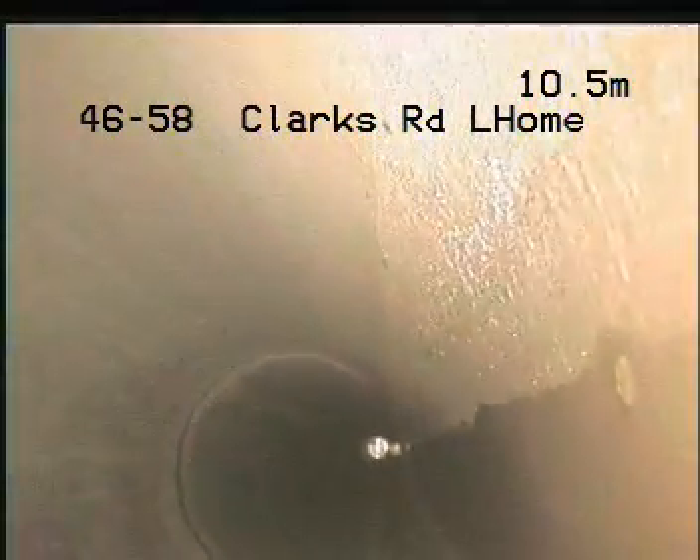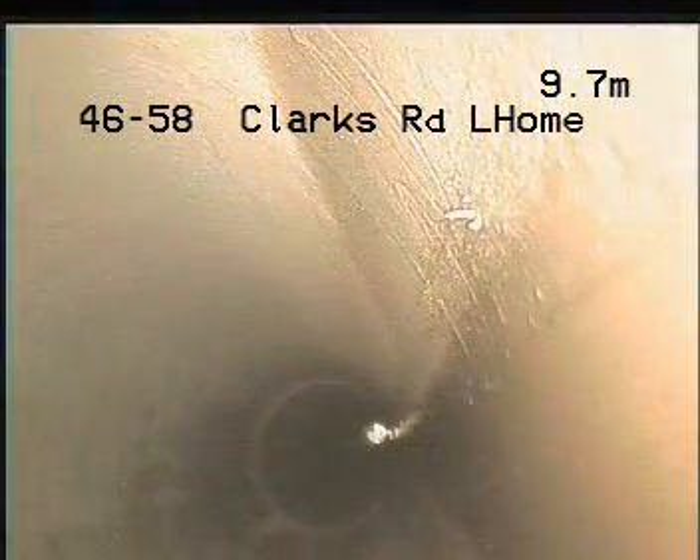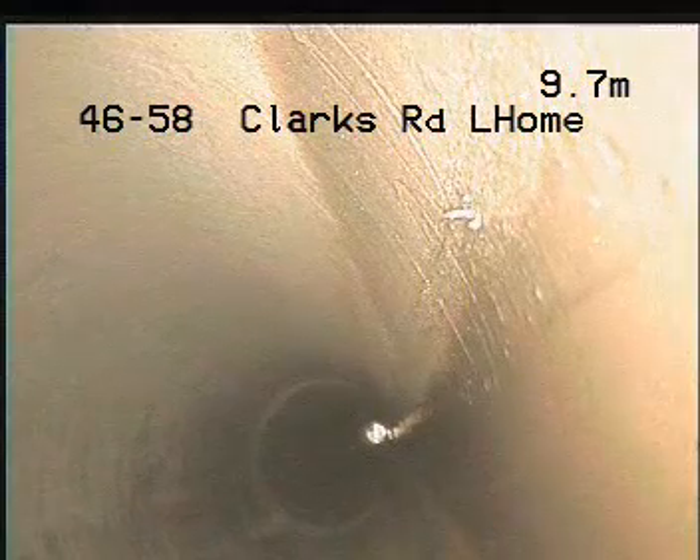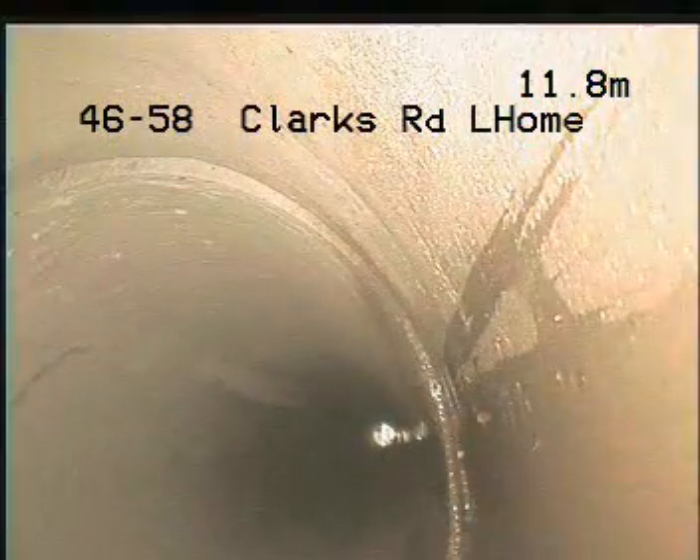Because the pipe is large, we'll go up. From here it's a two-foot pipe, fairly hard to camera. I just want to check — you can see the invert. I want to try and get it further up, it's fairly hard to get up these lines with reverse fall. We got it up to 13 meters. You can see the other end — this isn't the side where the erosion is happening.